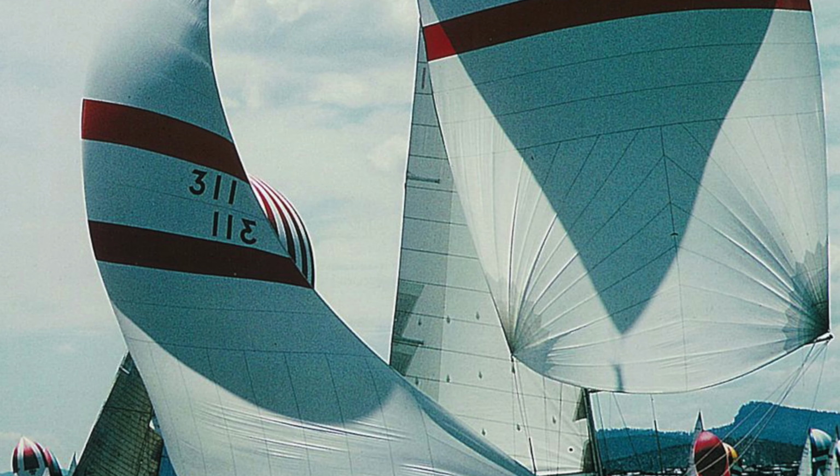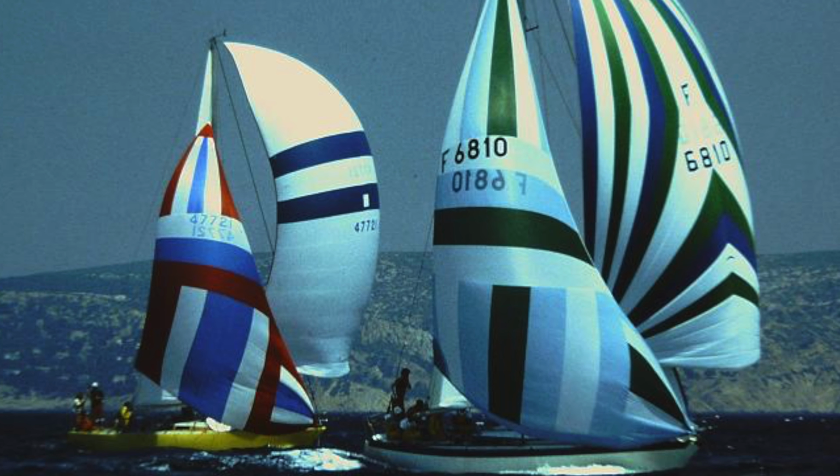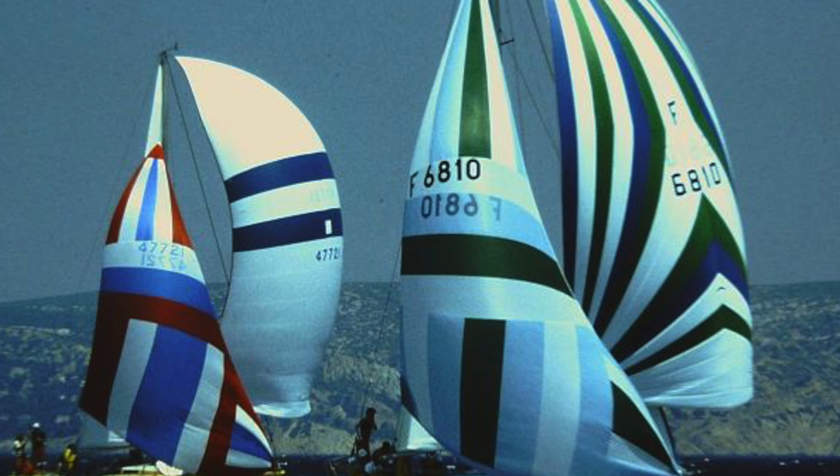We also have another head sail for light wind, which is more a racing sail. In France it is called a big boy, and it is usually hoisted to be in the opposite side of the spinnaker. So actually you put both of them to get a better balance of the boat downwind, avoiding it from rolling too much. About that sail, we know that we will never use it for sure.